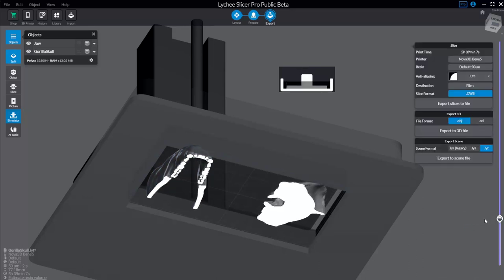Lift up, and you're going to hear it too. As it lifts up, you're going to hear a little whoosh, and that's basically this hardened resin on your FEP, or that plastic sheet at the bottom. It's hardening, and then it's going to lift up so it unsticks from the FEP, and you can control that distance in the resin settings, and then it'll push it back down to one layer above where it was originally. Harden that resin there, lift it up, and just keep doing that.